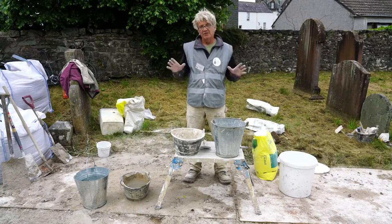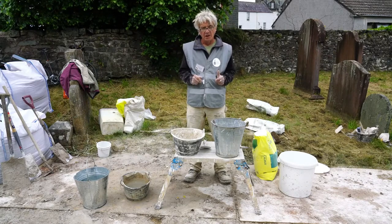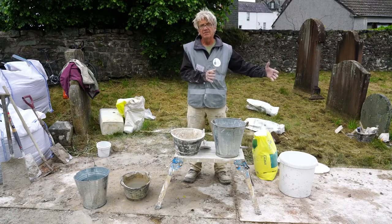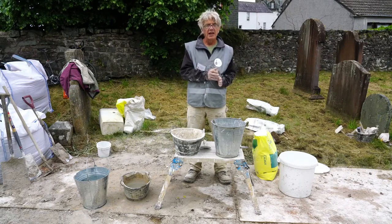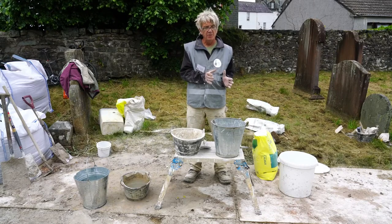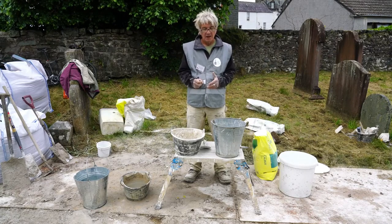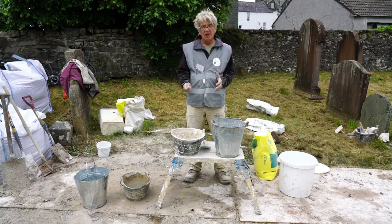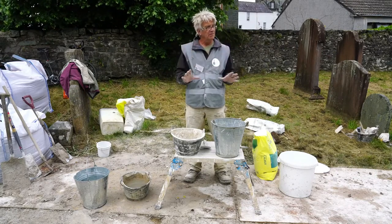When we started again, sorry, I have to go again to where we got things wrong or made mistakes or errors in the lime revival. Really we made lime wash from taking 3-month-old lime putty, typically, which historically they would say has already lost a lot of its binding power because it's been laid down for a long period of time, 3 months or longer. And we would dilute that, and if we diluted it such that it looked like a paint, had any thickness or viscosity to it, and we applied that, it would craze uncontrollably, really.